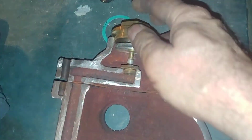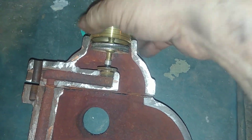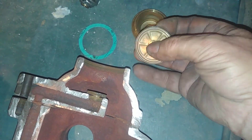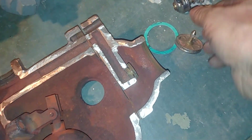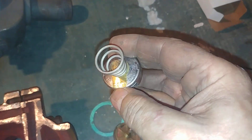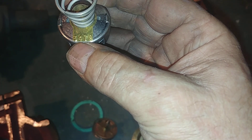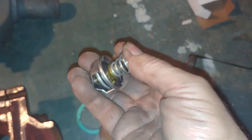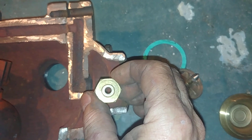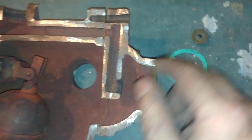We've got the other one we're probably going to do tomorrow. I just wanted to show you what's inside. This is the original thermostatic element from that unit. This is the cage unit that they say should go in there - that's a 3479, and this spring is not long enough. There is the seat, which is generally removed - this particular one requires a seven-eighths socket. And this is the path that the air takes out.